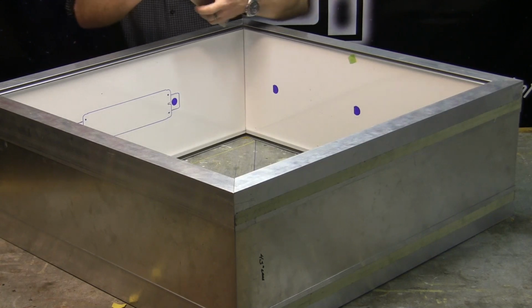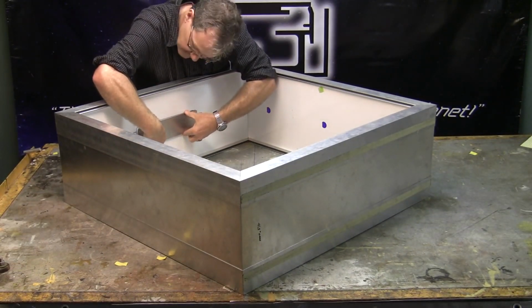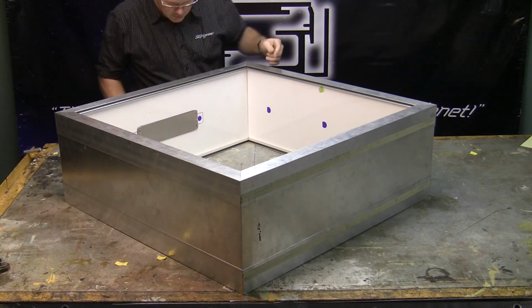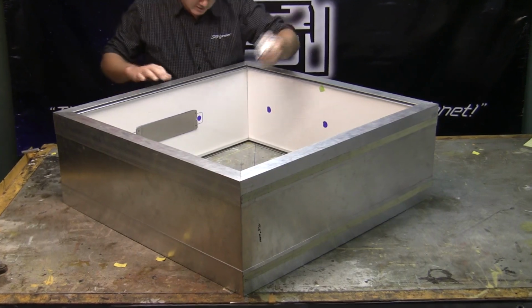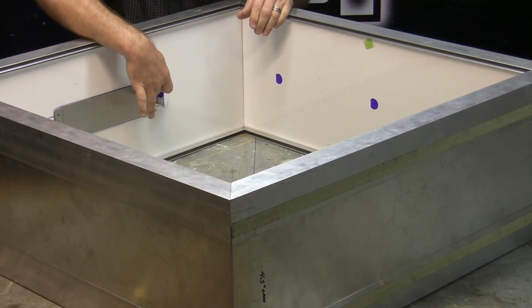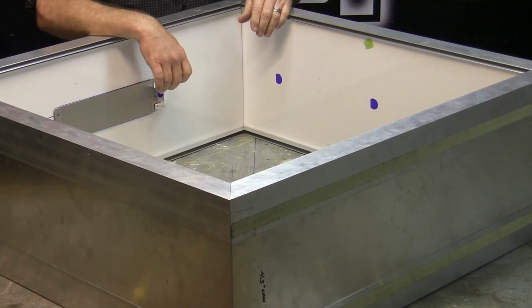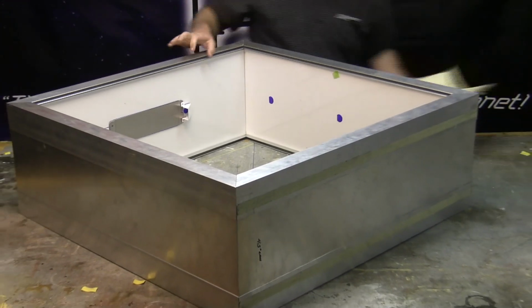I have a template here. It's a footprint that I make for the ballast. The ballast would normally mount right like this. Stick it in place. These would be drilled out. And you put a Heyco bushing in there. And then we take a doghouse or a teepee that mounts over the top there. And it creates a transition from the ballast into the raceway that creates a UL environment. So there we have a quick demonstration on how Signgineer works.